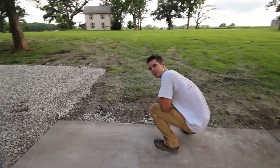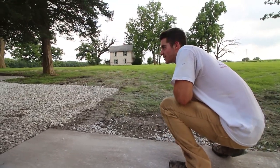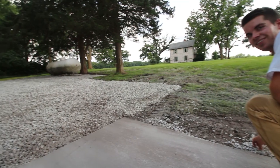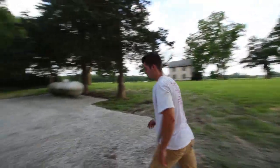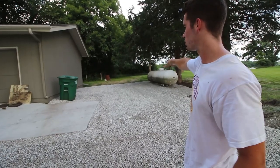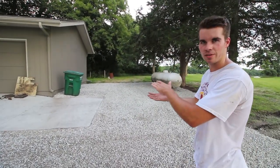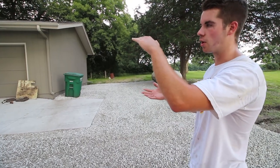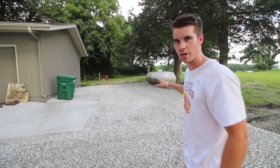It's a hard day's work. We got her all done, boys. There she is. Now, the one thing is we probably should have packed it down more with the skid loader, but we have a propane line running through the house. I really didn't want to pack it down over the area because I didn't want to sink through the propane line even further — it's probably a foot in the ground, but still, with all that skid loader pressure you don't want to sink it too much and blow it, because we did have a leak at one point over the winter.